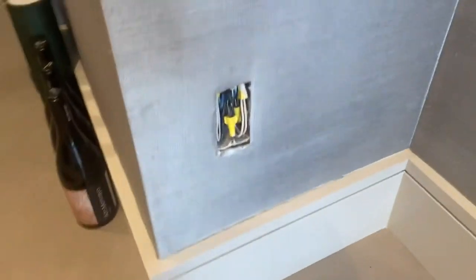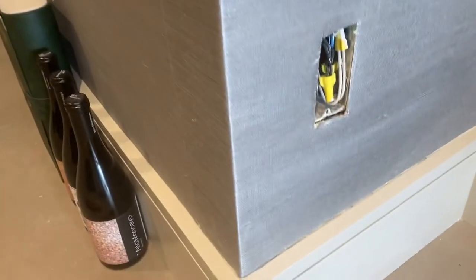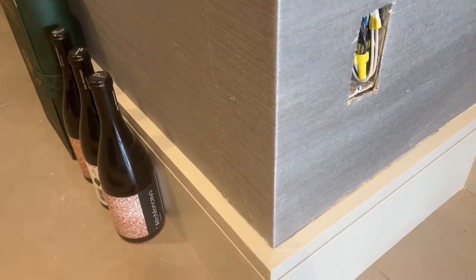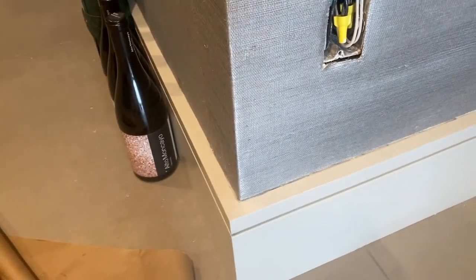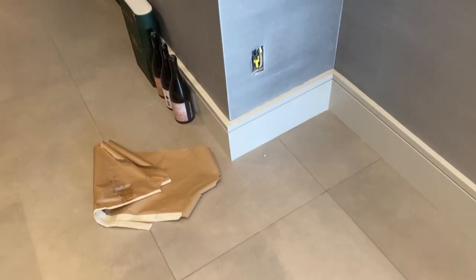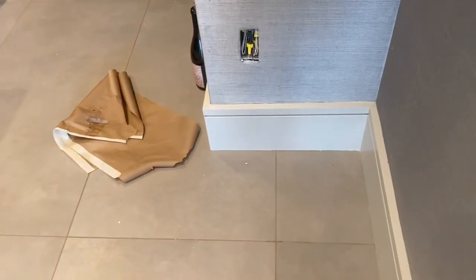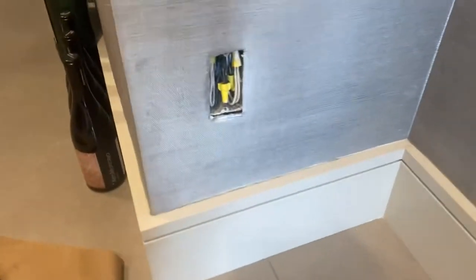Now, you'll have a white cloth with you that's just damp, not dripping, certainly not dripping. You can horizontally wipe down where you were working if you got any moisture on the product whatsoever. Lightly damp, but damp enough where you're not going to push the cloth into the grass cloth and then scuff it. You can bruise grass cloth.